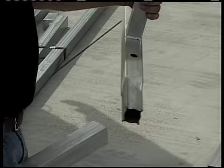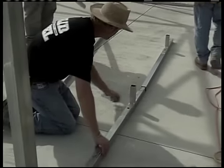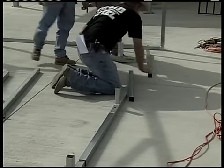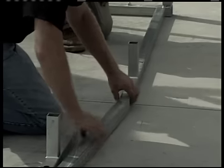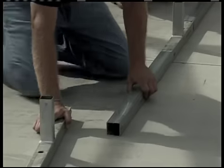To make the base rails for the back enclosure on this 20-foot wide building, we'll need 3 BE-T — that stands for Back Enclosure T-Shaped Enclosure Brackets — and 2 lengths of 2-inch by 2-inch tube that are 29½ inches long, and 2 that are 46¼ inches long.